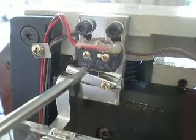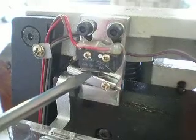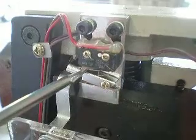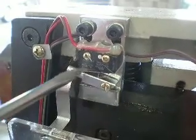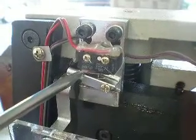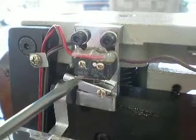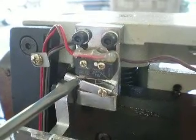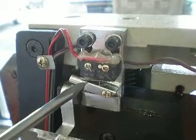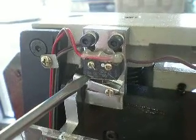Then basically from this point on, it's got a little groove right there in this little flat metal bar. I would bend it — grab it about right there with the needle nose pliers and bend just the end part upwards a little bit. If you bend just this last little end part upwards, again like a sixteenth or eighth of an inch, it would allow it to click center. So first try that, and if that don't work you can just bend just the end of this thing slightly up like that.